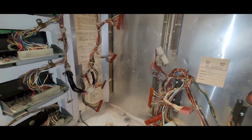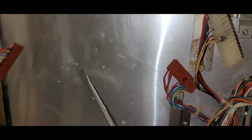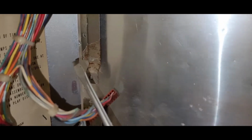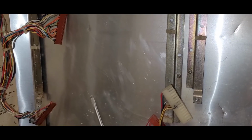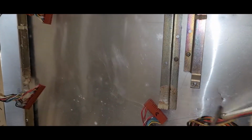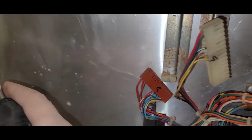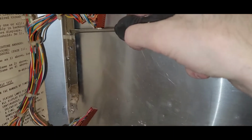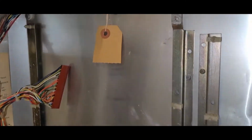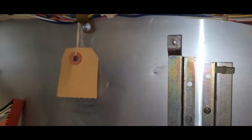Here, let's take a quick peek. Let's go into zoom mode. Well, this is actually just normal mode. It's the tiniest evidence, maybe, of old corrosion. Here's the evidence here. Often when the battery, which would be right around here, original battery, starts corroding, at the bottom of the board it spreads across and then up. Now look at that. Spread across and up. So clearly the board that was in here was not the board that got roached. Look at this, it even might have made its way all the way to the top.